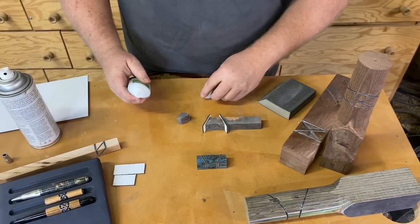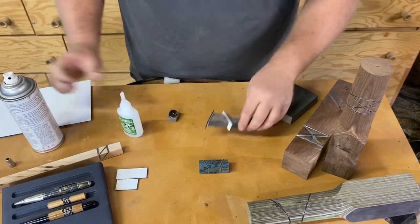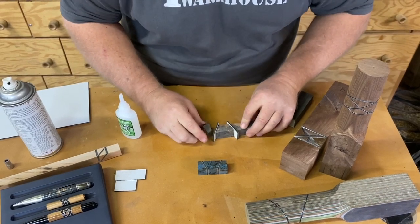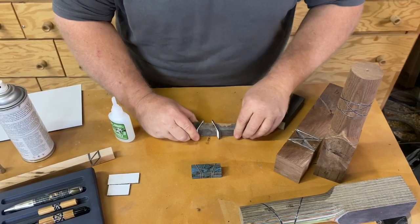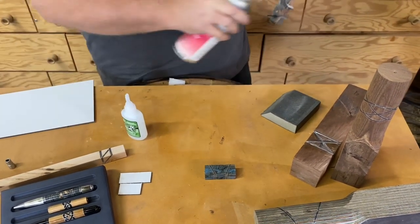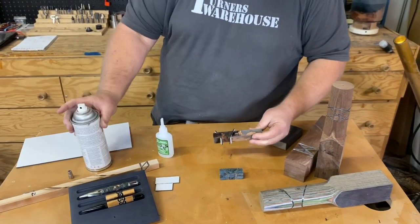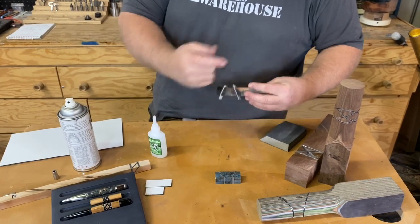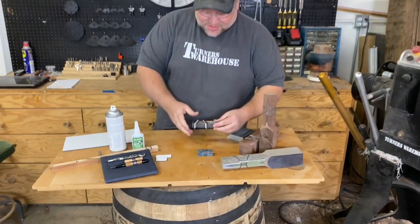So now we've got two parts. You want a good amount of glue — you don't want to go light on it because then you could lose your part. I'm going to line this up by eye. I stuck it a little bit low, but the way this end piece is, that'll actually work out. I can spray this to make sure everything's set. Even though I'm spraying accelerator, I want to give this some time to cure on the inside — that accelerator is only going to cure what it comes in contact with on the outside. Hopefully I got enough inside to cure the whole blank, but I'm going to let this sit a while.